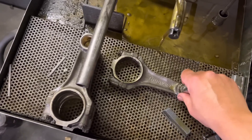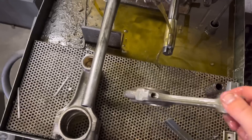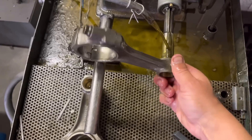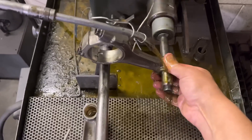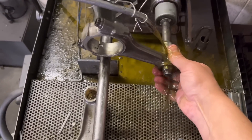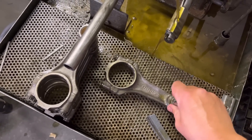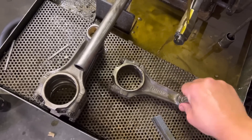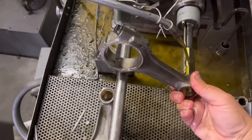As I say, we just frequently turn the rod round. See - that's starting to go in there, it's just starting to pinch that pin. So we've just got another half a turn cut on there. Once you get to this stage, you just go backwards and forwards - see, that's almost in there but it's just pinching it. What we do is turn the rod.